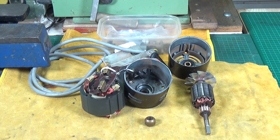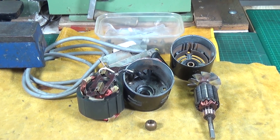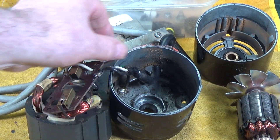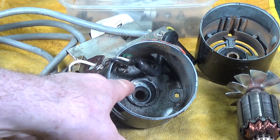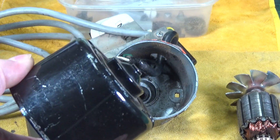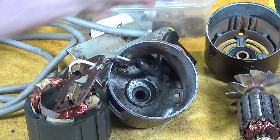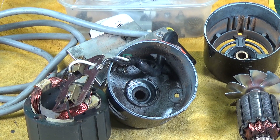First of all, Kev from Mr. Factotum's Workshop, who made the brilliantly simple comment: why don't you change out the oil-lite bearings and fit a ball race bearing? So I thought, yeah, that's not a bad idea. We'll close in on the motor casing - you can see that the casing is cast and it looks like it's been cast to take a ball race bearing, same with the other end. However, when I removed the oil-lite bearing and measured it up, I can't find a ball race bearing that will fit that hole anywhere, so that's kind of snookered that one.